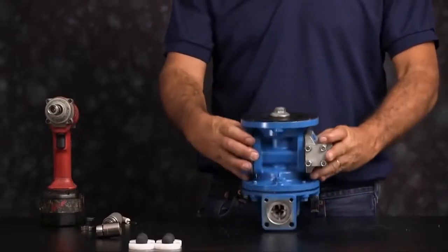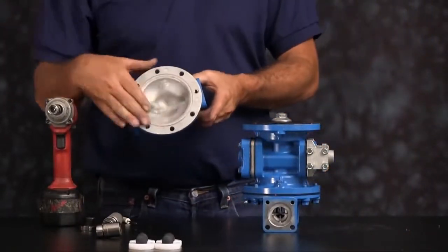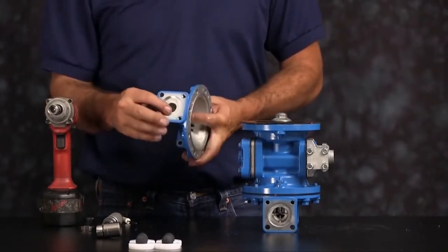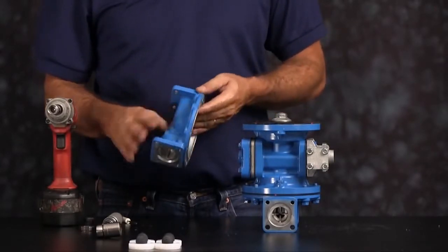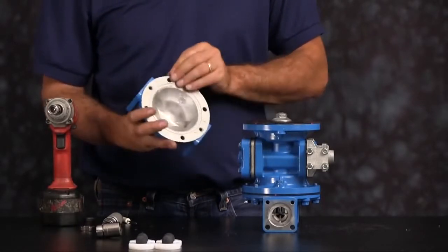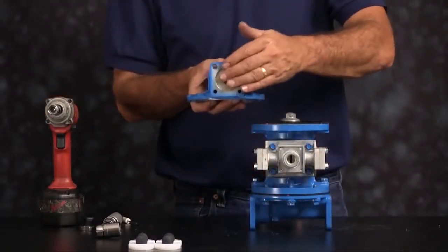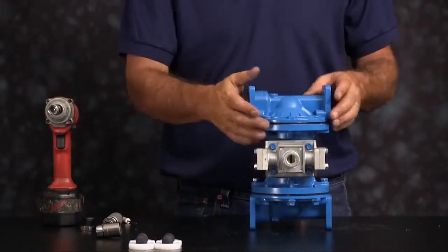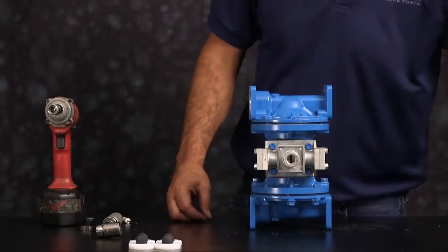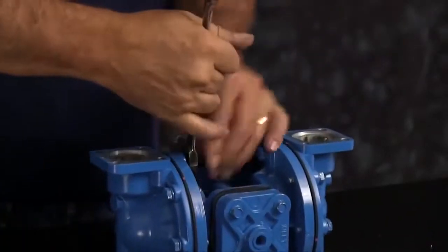Remember to inspect the second outer chamber. Inspect the machine faces and radius of the chamber for damage or material buildup. Scarring, scratches, or material buildup can be cleaned up by using emery paper, crocus cloth, or fine sandpaper. Ensure the radius on the inside of the chamber is maintained during cleanup. When aligning the outer chamber, be sure that the discharge port faces the nameplate. Thread your bolts in and then tighten them in a crossing pattern.